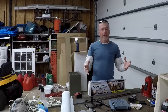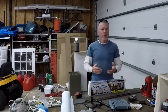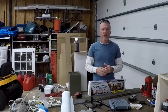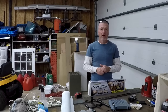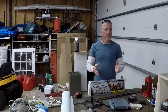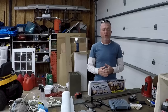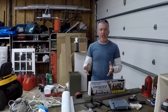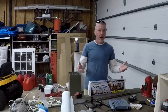That's about it. That is a 24 by 30 garage, pretty standard, 6-inch eave overhang, just a rake board, so a zero overhang on the gables, 4/12 pitch on the roof. It did have two doors as opposed to one 16-foot overhead door, service door, no windows, and we even replaced the OSB with the blackboard to save cost.